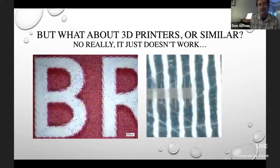And I can't say that modern print technology is any better. Here on the left, we see an image taken from the cover of some glossy magazine. Industry standard is around 300 DPI. Anything above 600 DPI is generally considered unusual in industrial printing, even for big name glossy magazines. So the ruler at the bottom shows 500 microns or 0.5 millimeter. And to the right, I have an image using such lithographic technologies, which also has a ruler 500 microns long, 0.5 millimeter. And you can see exceptionally fine detail has been recreated, which is simply not possible using modern printers.